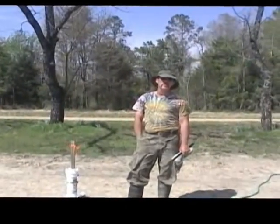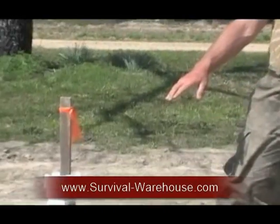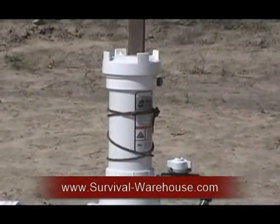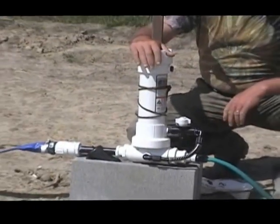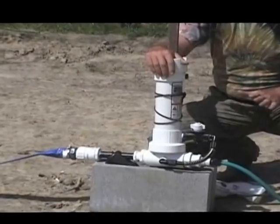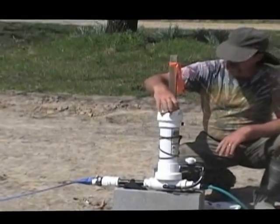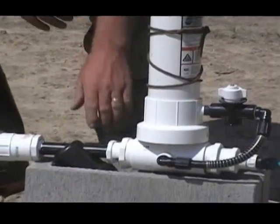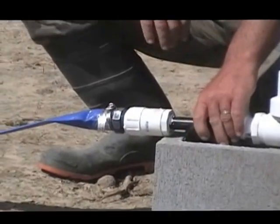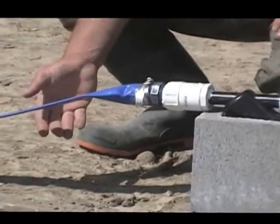Now that the plasticulture system is all in on our field, we're going to show you and demonstrate how to do it and some of the things involved in this. For instance, this right here is a model 320 manufactured by Pentair, and this is just a swimming pool pump, you know, for putting in like bromide. And so for our purposes, this works just fine. What's great about this is that you can actually put liquid fertilizer right down here and turn your dial to get your concentration. And then it comes over, and of course you have your filter that helps filter your water just in case you have anything in there. And it goes from there into your main feeder line.